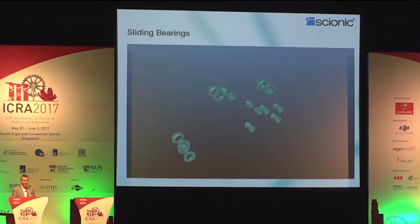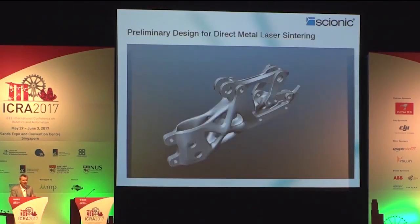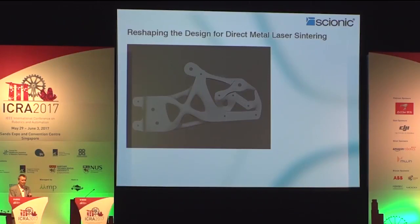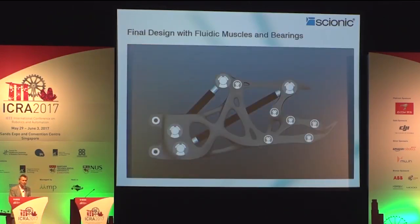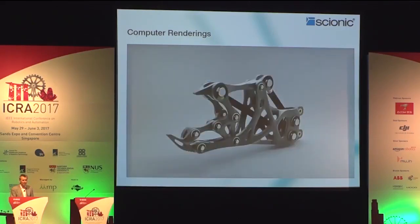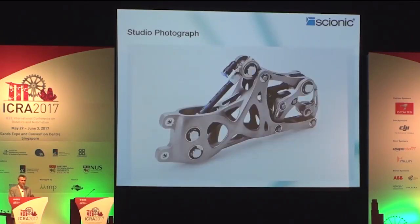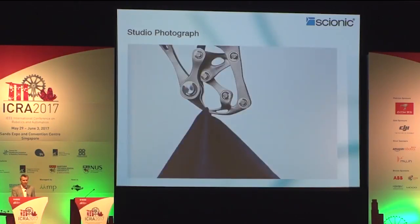Only here the friction bearings needed to be subtractively manufactured into the piece. All 3 grippers were designed in a way so that they can only be fabricated by 3D printing. This was another prerequisite, that we do a form finding which cannot be traditionally or subtractively machined. Highly integrated, powered by artificial muscles, which are also co-developed, and they are industrial components capable of very many load cycles before they deteriorate. And here you see the difference between the final printed product and also the previous computer work for that.